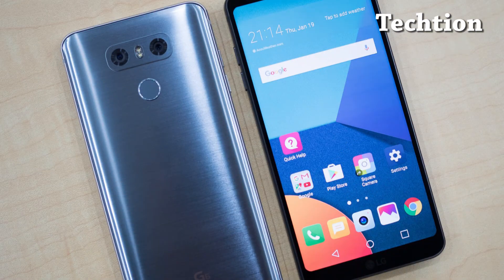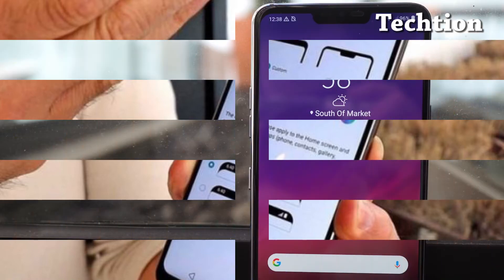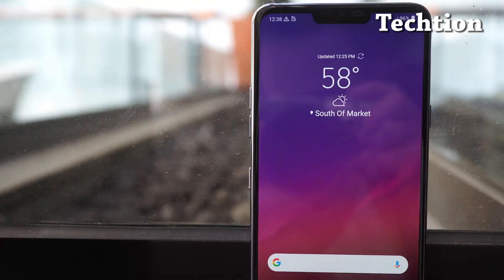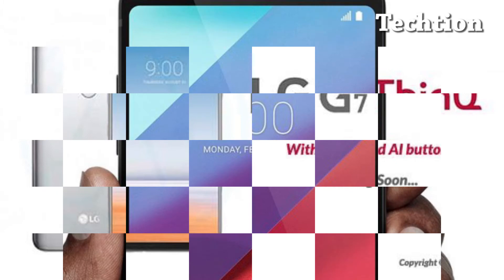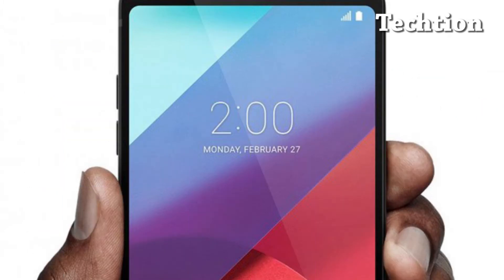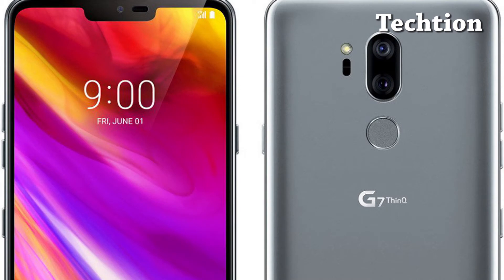It's included as a fourth element in a traditional RGB pixel stripe. Each full color pixel in an MLCD Plus panel consists of RGBW subpixels rather than just RGB. This has implications for subpixel density for a specified panel resolution. The subpixel sizes could be made smaller to increase the total number, but that partially defeats the point of trying to improve peak brightness, as smaller pixels are dimmer.